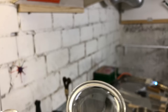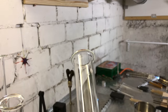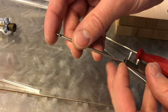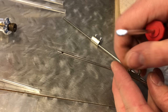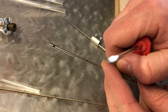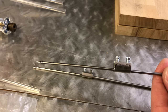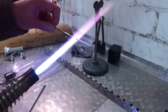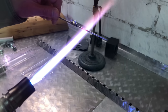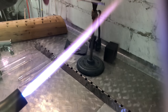The result is a beautiful flange that provides a smooth and nice bearing surface for the O-ring. It always amazes me how easy something looks when it is done by someone who knows what they are doing. The next step is the vacuum feed-through. 2.4 and 1.6 mm tungsten welding electrodes were used. To be able to hold them better, they were fixed in a special holder. To ensure a vacuum-tight connection, the electrodes were heated in the flame until a thin oxide layer formed on the metal. This layer ensures a good connection with the glass.